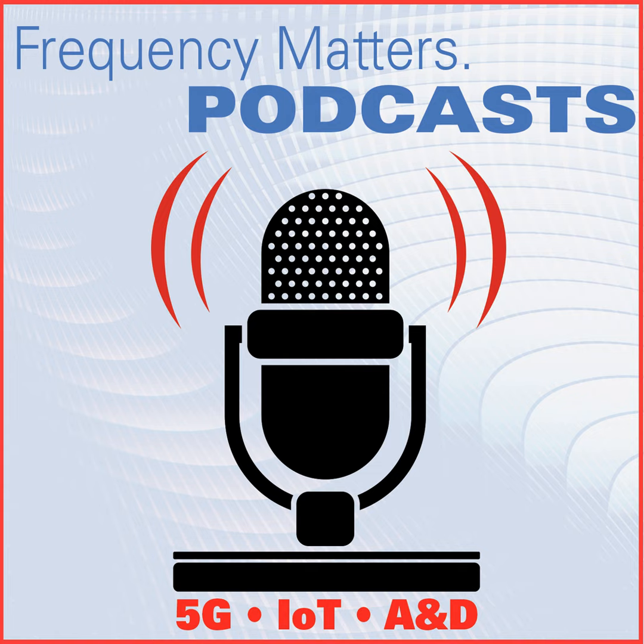Apollo MX-FE consists of two different variants today, and we're developing a host of wideband transceivers under this trade name. The first part is the AD9084 — our widest band transceiver. It's a 4T4R device that can sample at 20 gigasamples per second on the ADC and 28 gigasamples per second on the DAC. The RF bandwidth is from DC to 18 gigahertz, and the instantaneous bandwidth is up to 10 gigahertz.